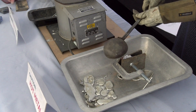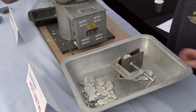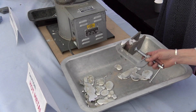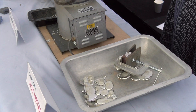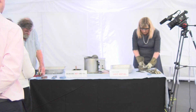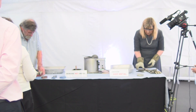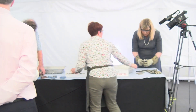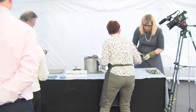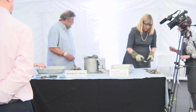Just put the flat side down on the side of there. You can see how it's wobbling just a little bit - that's fine, it doesn't need any more. That's okay - you can probably lift that out and open it up. Use the pliers because it's obviously still going to be quite warm. Then just drop it into the water to cool it down so you can cut off your sprue.